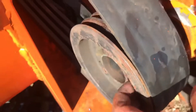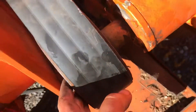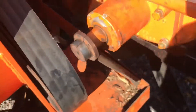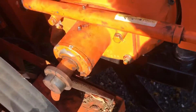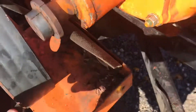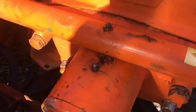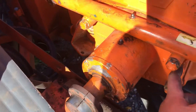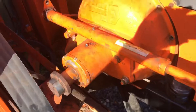It was seized on there pretty tight. You can take a three-pound hammer and tap the other side of the pulley — be careful not to bend anything — and it will pop off. If it doesn't, you'll need to get a pulley puller and pull it off. This one was really seized up. Anyway, once that comes off, you don't have to worry about the bolts holding the drive line or clutch in place.